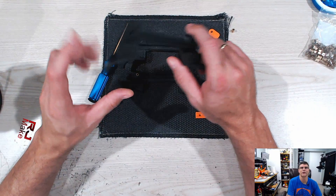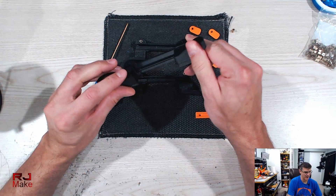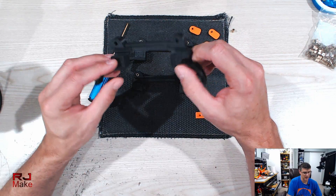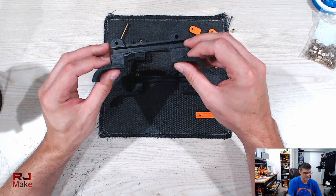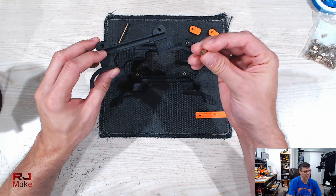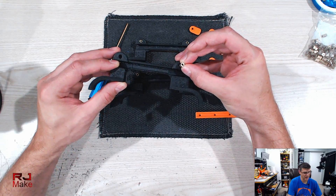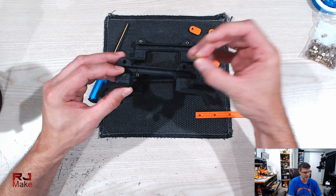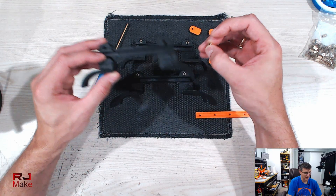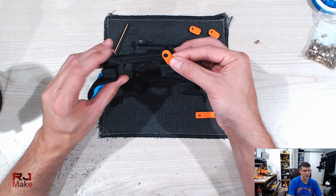So I want to spend a little bit of time talking about these skids. Here we have one of the many prototype revisions — this is just a printed blank. You'll see the holes right here, and what I do is take these brass knurls and use a soldering iron to melt them into the plastic, then do a little twist once I've recessed them in where I want them. This gives that front latch an incredible amount of strength.